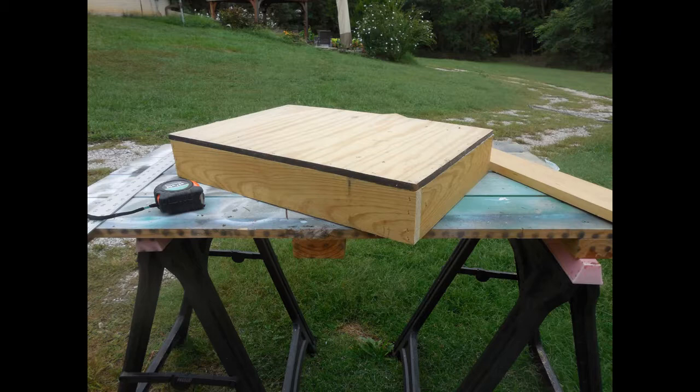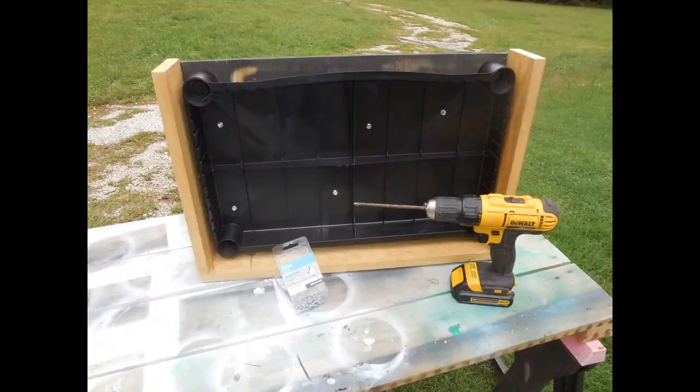This is what the top of the tombstone will look like once you cut all the pieces and put them together — it will be closed on three sides, but the back side will be open. Now attach the wooden top to the top plastic shelf using screws, being sure to leave a little space around the shelf so it will slide on and off the top supports easily.